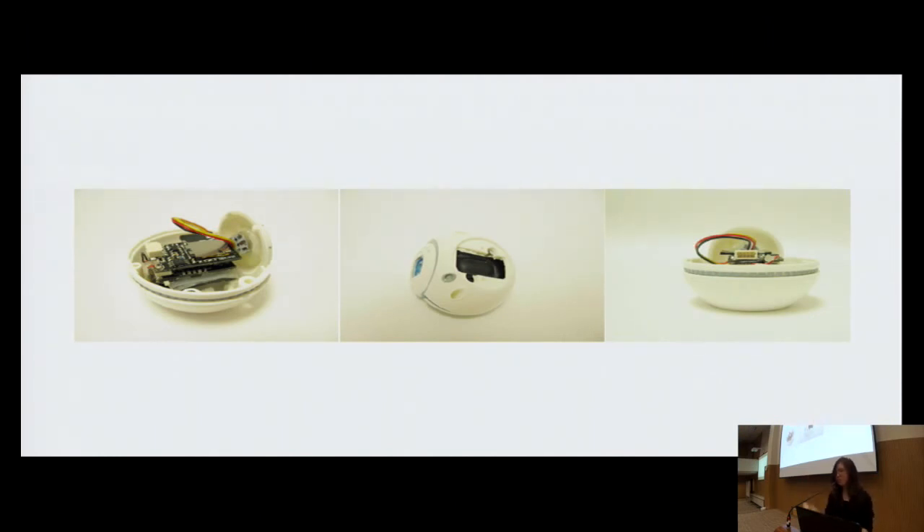The other side, which is being covered right now — that's where the speaker is. We're reusing the lid of the battery cover as a kind of diaphragm for the speaker to make it sound better. Handheld speakers are very, very small — they're very good for high frequencies, but you can't really hear them well. It becomes a lot louder when you actually have a diaphragm or lid over it that can vibrate. The lid is actually pretty thin, so we found that it works quite well. We just cover that back on and you don't really see the speaker. Looking at the third photo on your right, you can see everything stacked up — and that's only half of the ball. So there's still plenty of space to maneuver.